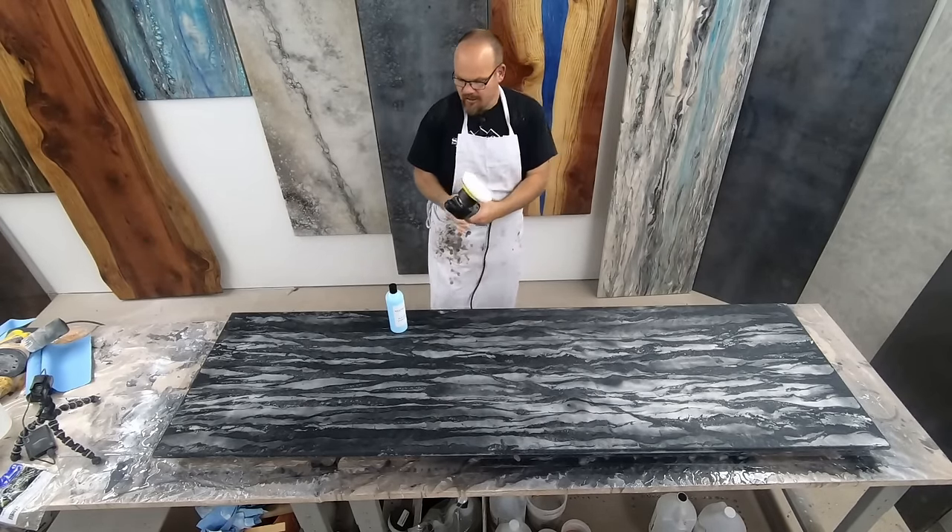We spent a little bit of time taking this and sanding it all the way down to 220, as if we'd run into some deep heavy scratches. What do you think of the finish, Mitch? It looks awesome — the shine's a little bit lower, which I actually like better, it's a little more natural. Right, it's beautiful. You get a lot of phone calls from people looking for a lower sheen, not so plastic-y, and this is what gets you there. It's also insurance down the road — if you scratch your counters up, you can bring it back to this sheen easily. We've been working hard to figure out which pads to use and how to get the best system, and we'll continue to look for the best. This is a good system — it's really easy to follow, it's repeatable, you don't need water, and you can do it safely in the house. Just tent up and hook your sander to your vacuum — run some plastic to isolate the area — and you'll get very little airborne dust.